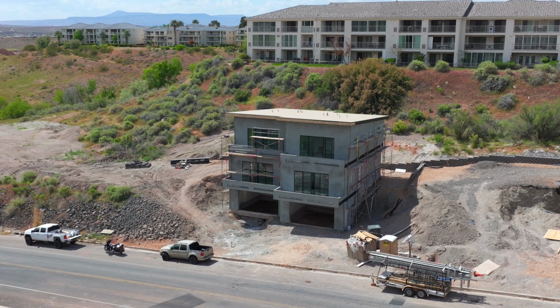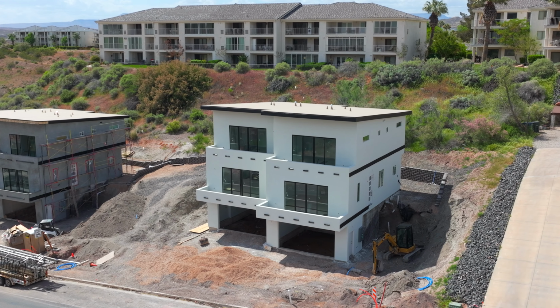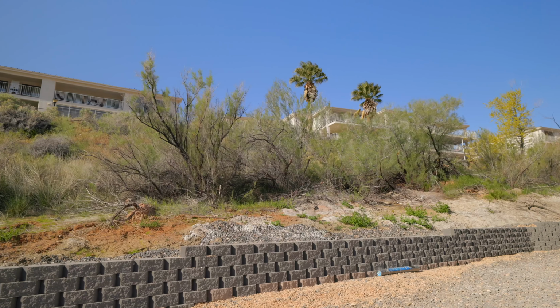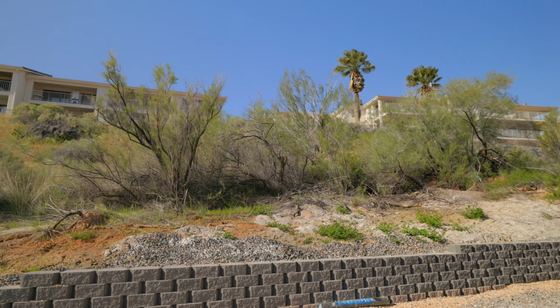And this is what Johnny's solving for. He's maintaining that flow of water. Now, they tried to stop it. That's a mistake. If water is coming through your property, even if there's not a defined easement, if water is coming, you can't stop that. You've got to find a way to get it away from the home or get it away from blocking or causing damage to the home. That's basically what Johnny's doing here on the job.